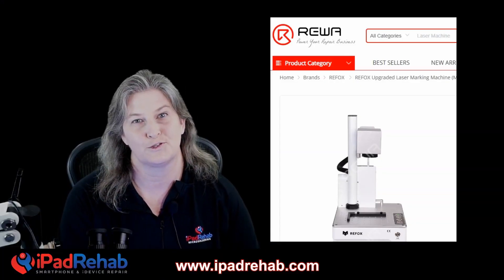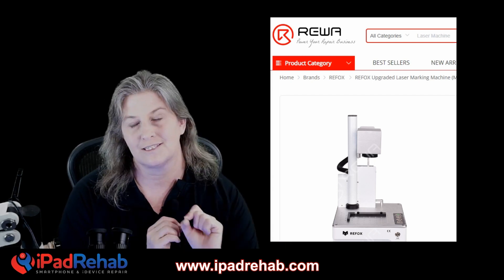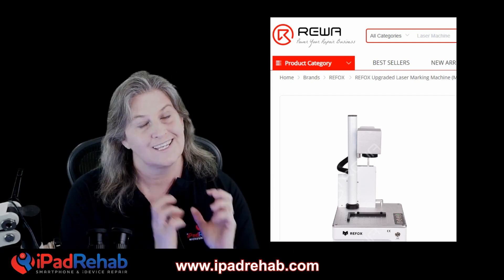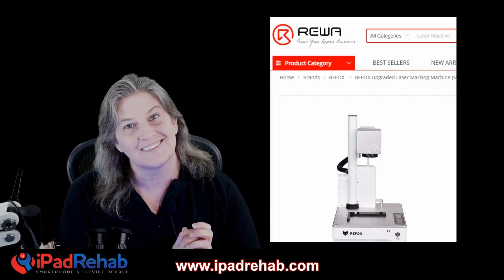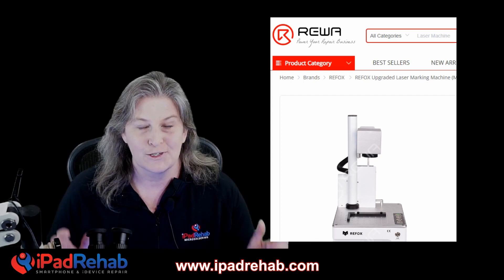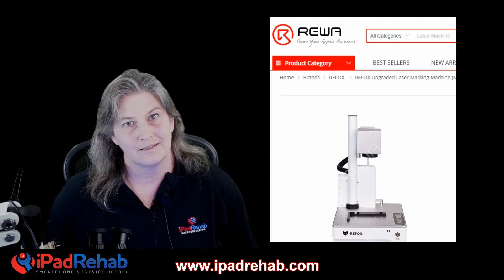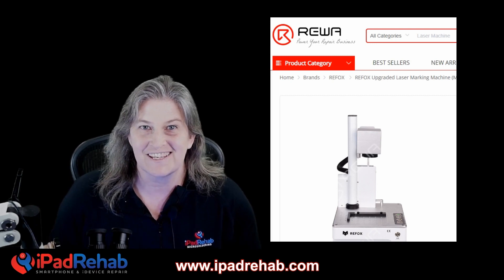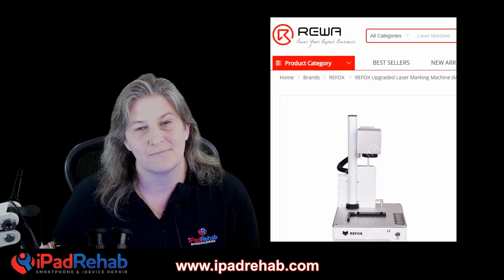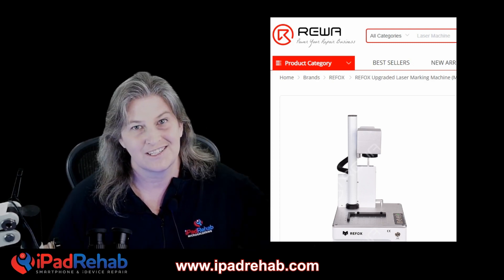That's the deal with this one — it's pretty typical. We've seen not just those two resistors damaged but also capacitor damage and filter damage in that same spot. The laser can get to your board, so take your board out when doing back glass repairs. If you run into any camera issue post-back-glass repair, learn how to micro-solder with us — come up for training, or you can mail in the repair and we'll take care of it, just like we did this one. Thanks for watching.